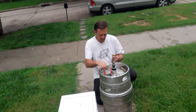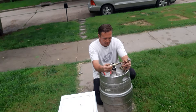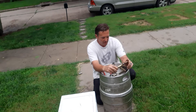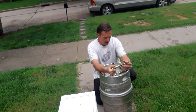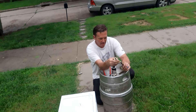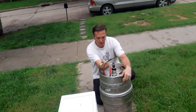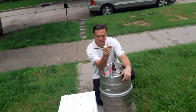I spent a little bit of time this morning tapping this all out — three quarters to half, half to three eighths, three eighths to quarter, and then if you wanted to you could go quarter to eighth. If you're a plumber or you're messing around with plumbing and you're short a coupler, if you have a tap set you can always just kind of make your own fittings by doing that. Anyway, I spent a lot of time on this.